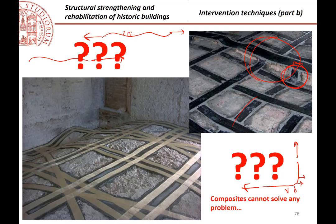You can do it, but as I said before, FRP work very well with epoxy resin, and if you are using a layer of mortar too high, then that one will be the weak point of your application. So if you must use a large thickness, then it is much better to use FRCM that are appropriate for that, because the interface stresses that they require are smaller. When you use epoxy resin, you want to use all the strength of the fibers, and you cannot add a weak surface which is realized by the mortar.